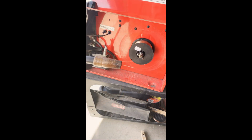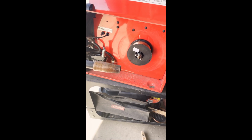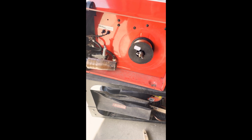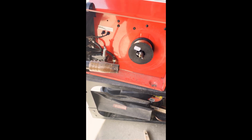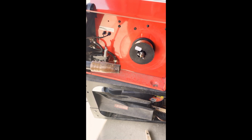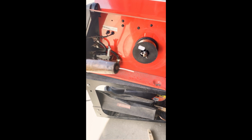All right, got tired of how long it's taken using 30 wire, and 30 wire is kind of your general purpose, semi-structural. Went down to the big blue store. They have 25, and that's about as low as they go. I'd probably like 20, but we'll see if 25 can go. Other problem I had is the tips they had for 25 wire were not the ones for my welder. So I have one 25 tip. I better not screw this one up.